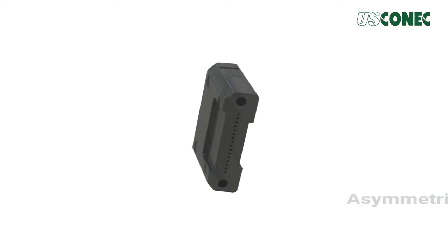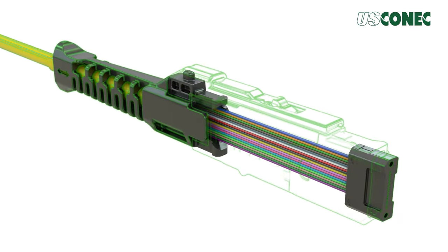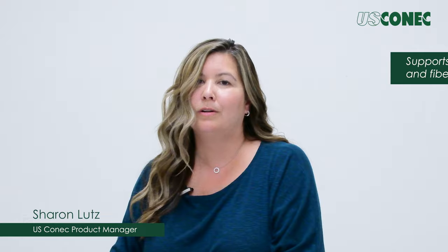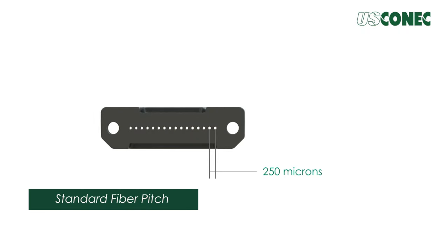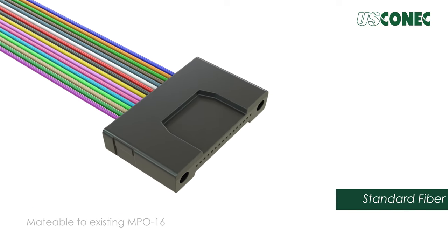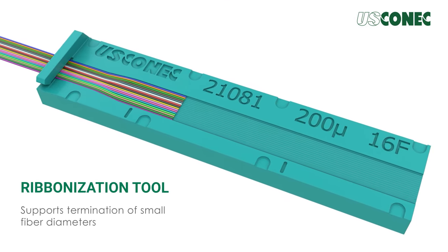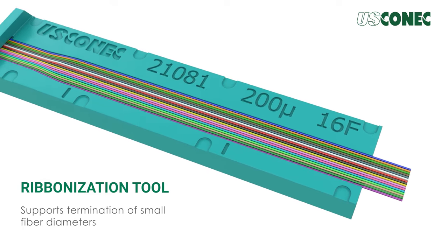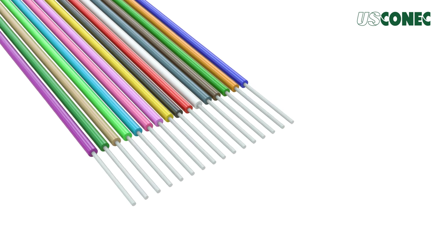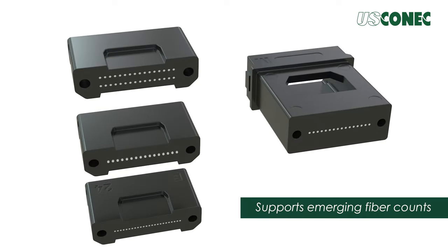The ferrule design incorporates asymmetrical geometry, enabling simplified assembly and polarity management. This ferrule is designed to support today's fiber as well as the fibers of the future. With a fiber-to-fiber pitch of 250 microns, the TMT ferrule is mateable to existing 16-fiber MT ferrules and compatible with current fibers. For emerging smaller outer diameter fibers, US Conec has developed termination tools to transition fiber pitches to 250 microns. But the TMT ferrule is also adaptable for tighter fiber pitches and increased future fiber counts.